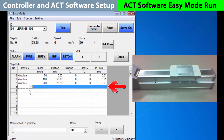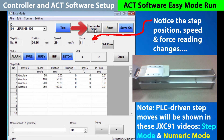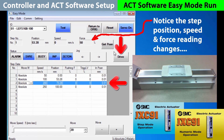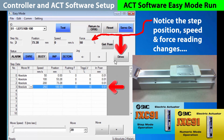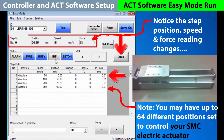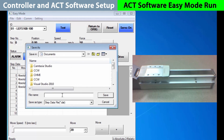To finish, let's just type in step move number three. Pick an absolute move, then go 250 millimeters per second to the 100 millimeter position. Let's try out our moves now. First, start with a return to origin. To get to step move one, just select it and press drive and it goes there. While it is driving, it will say busy until it gets to the end position. Do the same move for two, then move three, and finally back to move zero — which are all successful moves. These moves are saved to the actuator, but you may keep them for future or duplicate setups by saving the file to the PC.